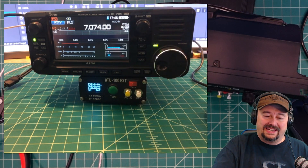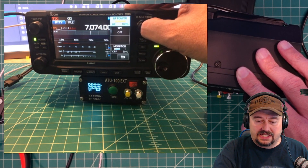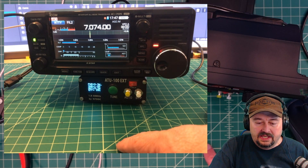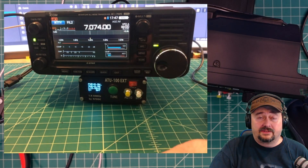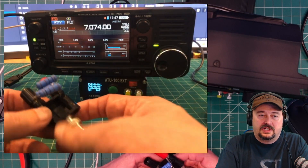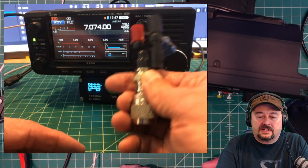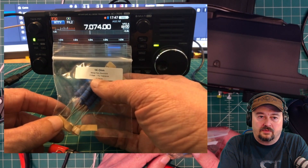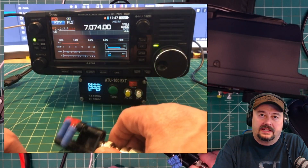Hopefully everybody can see this okay. We are set at 10 watts out. So when I key up, we should see some live action down here on the SWR meter — and we do: 9.2 watts forward, SWR of 1.5. Now this is not reproducing the crazy behavior that I saw the other day, which I find a little bit disappointing. So what I did decide to do is I decided to make this test jig. This is going to be a dummy load at about 333 ohms, and that should give us around a 6.5-to-1 SWR. I just made that using some 1 kilohm 3-watt resistors. So let's get this hooked up and see what happens.